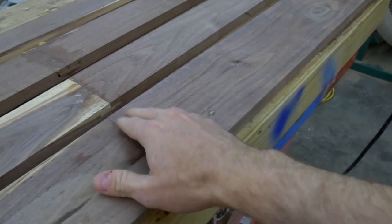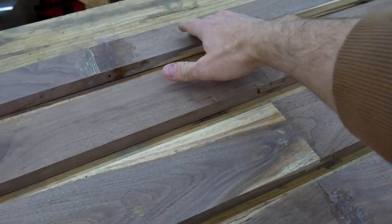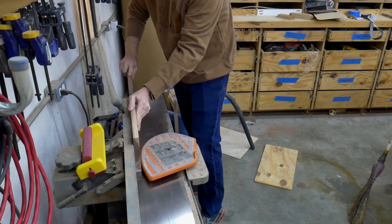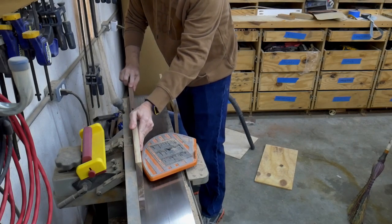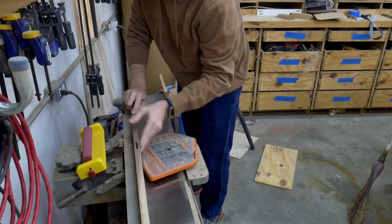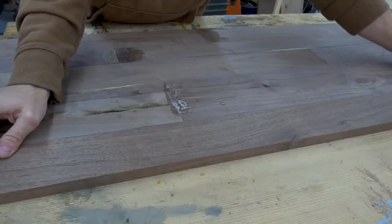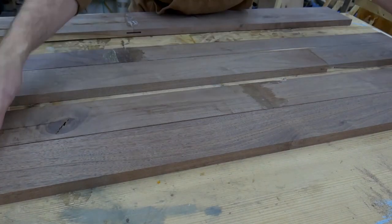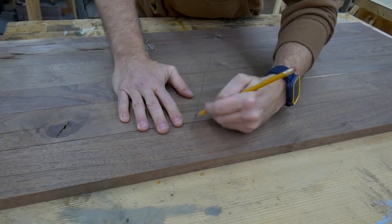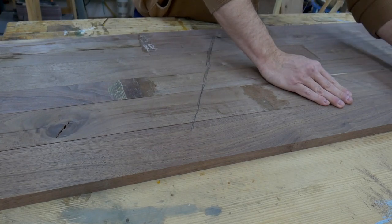The lengthened boards all turned out well. Any slight bowing or cupping can be corrected during the desktop glue up. The edges of each board are cleaned up once again at the jointer just to take care of any additional glue squeeze out or unevenness at the butt joint. Now some time is spent to arrange the boards to make sure none of the butt joints are too close to each other and the best faces of each board are all on the same side. Once I am happy with the layout, I mark a large V on the surface to keep track of the orientation during glue up.